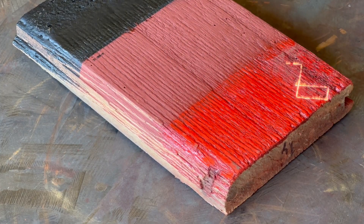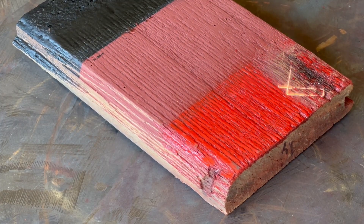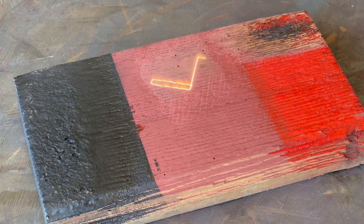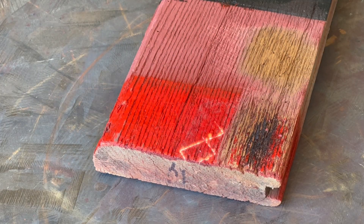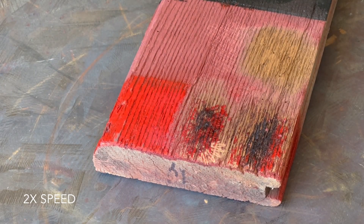You can see the laser did a pretty good job at removing the many coats of high heat engine paint. However, I kept the laser in the same area for too long and did burn the surface. After that, I kept the laser moving, but there were some small stubborn spots where the paint had collected and built up within the recessed grain. Cleaning the area that was only painted with primer was easily handled. I kept cleaning to see if it would burn, and it didn't. There was just something about the engine paint that was more prone to burning, and going back to Revolve mode caused it to burn as well.